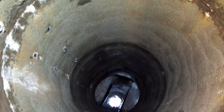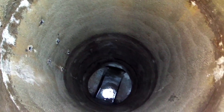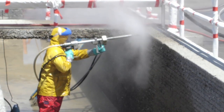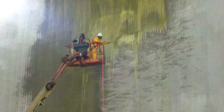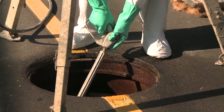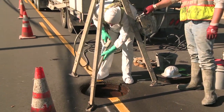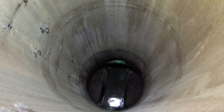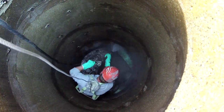The rehabilitation process begins with surface preparation. Surfaces can be prepared by water blasting, pressure washing, abrasive blasting, acid etching, hand or power tool cleaning, or any combination of these. Regardless of what method or methods are used, all unsound concrete, contaminants, dirt, and debris must be removed prior to mortar application.